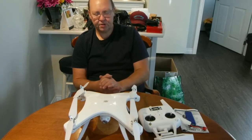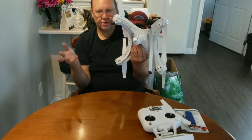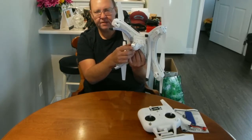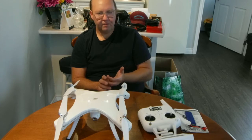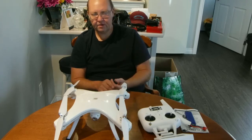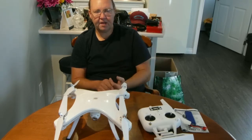Now, the other thing I want to mention while we're here is the camera for recording. The card, you do get a 4 GB card with it. You could go larger. I don't know where it maxes out, but experiment. But the card must be in the camera to record video. You can put the card into the screen, but that's only for viewing your pictures and videos on screen if you want to review them, as well as formatting that card, because it has its own formatting routine. Now, all your files are saved in an AVI format, which is fine for PC users and just fine for us Mac people.